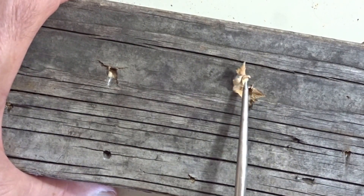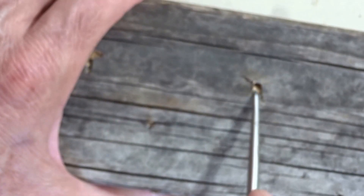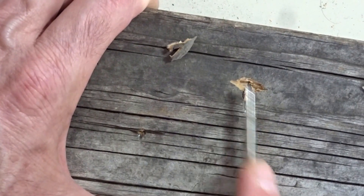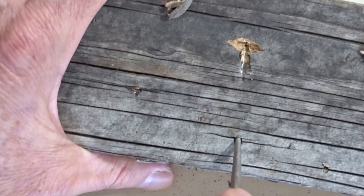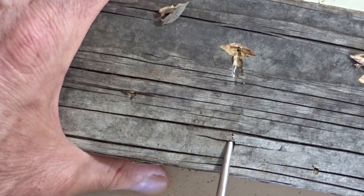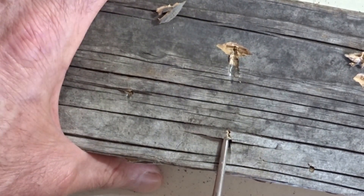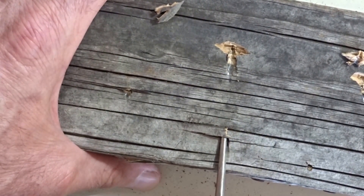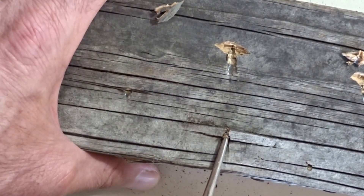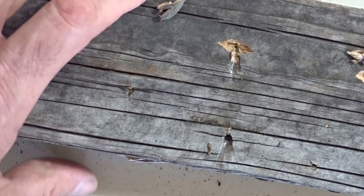We just get a very small chunk of wood — no splintering noise. Again, another small chunk of wood. Getting a little bit of splintering but again it's breaking right over the tool. That's an indication that we have the beginning of fungal decay, and this member should be replaced if it's a structural component of the building.